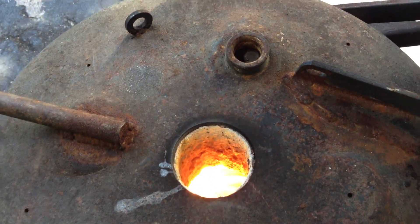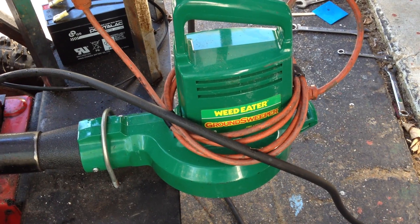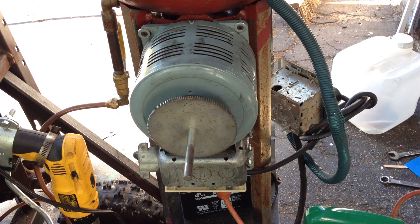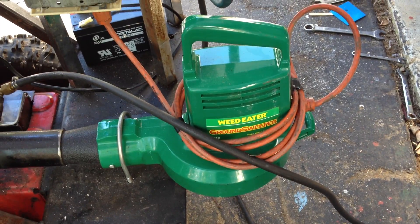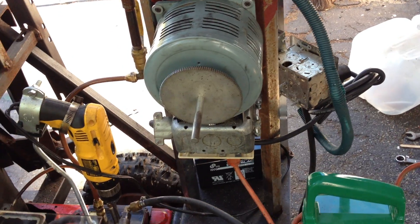As you can see, it's running quite nicely — nice and toasty in there. Air is provided by a leaf blower. This is way overpowered, so it's run with an autotransformer, a variac, to adjust the speed. I'm running it at a very low speed. I will probably replace this with a much smaller blower eventually, but I had these components and this was easy to set up.